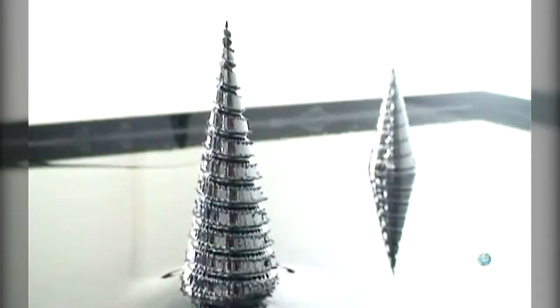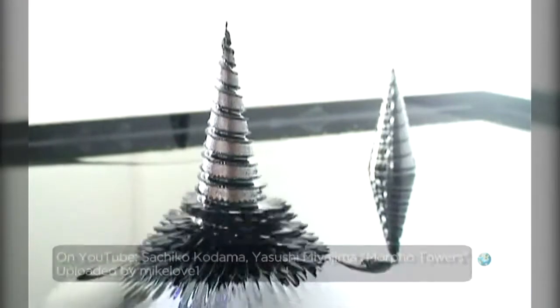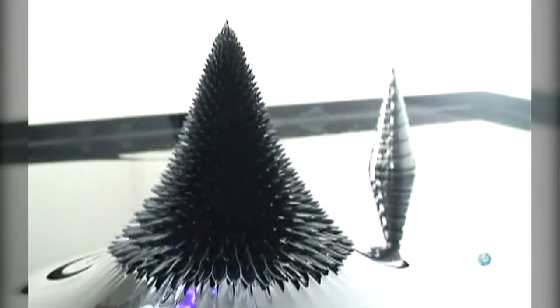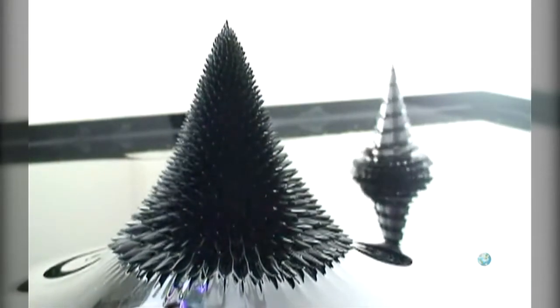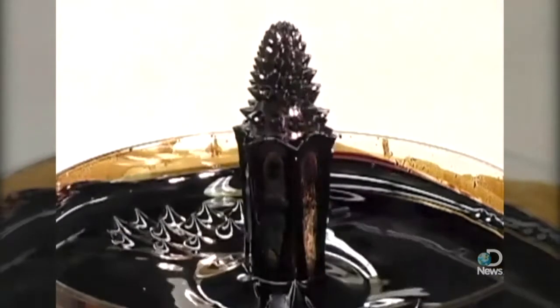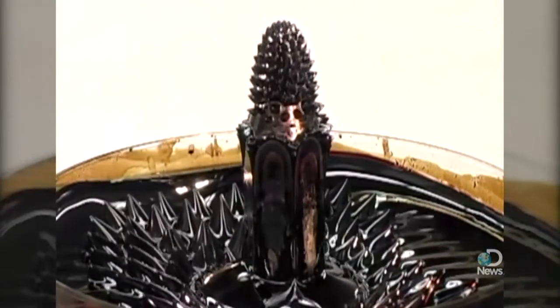So what's in it? Well, it's a mixture of a carrier liquid — usually an oil — and magnets so tiny they're measured by the nanometer. That's a billionth of a meter. These little magnets are coated with a surfactant to prevent clumping. That's a key thing: putting that surfactant surface coating on so they don't agglomerate.